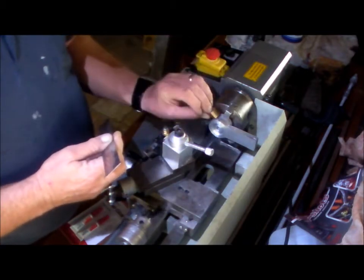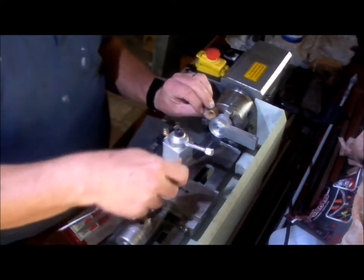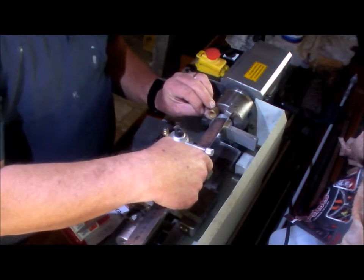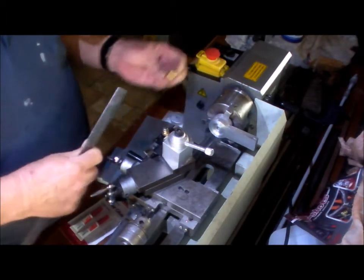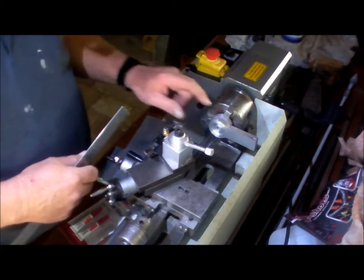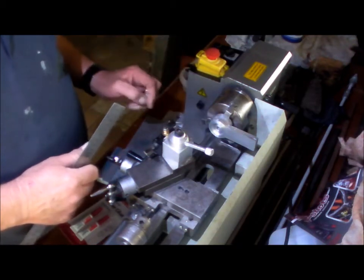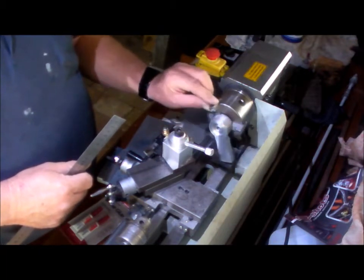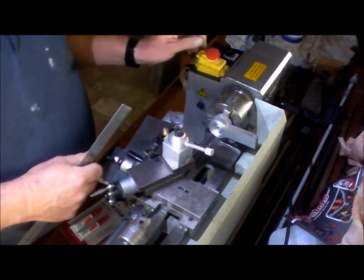This is the size of the bush, and as you can see this is a little bit better than the other, but I've still got about eight or nine millimetres not covered by the bush — so I've got plenty of room to play with it. The outside diameter of this hub has to be taken down to match the size of the hub on the handwheel, so I'll get back to you soon.